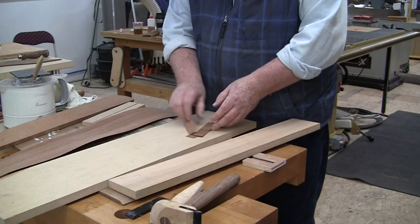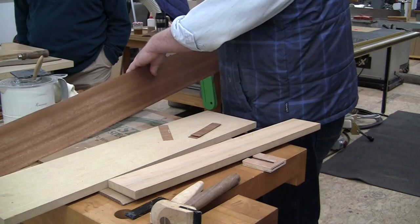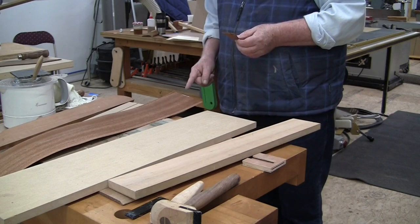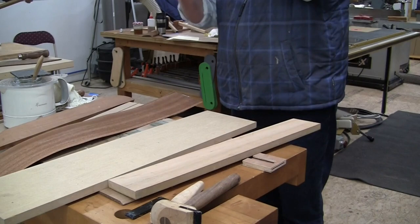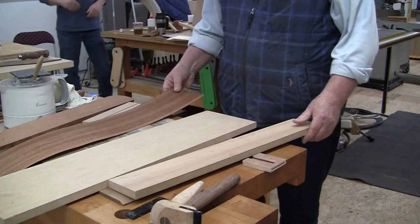So I have marked, somewhere, there it is, I have this chalk mark. All of these pieces have a chalk mark that, when I cut it off, was on this end of the wood. So when I put these down on the board, whether I put this chalk mark towards the middle or to the outside, as long as I'm consistent, the chatoyance going around it is going to be consistent. Okay? And the chalk comes off pretty easily with all the water and everything that's flowing. So the method for cutting this is exactly the same method.